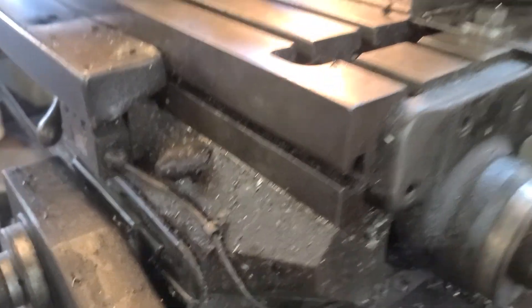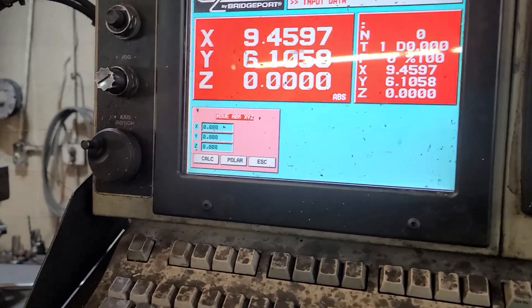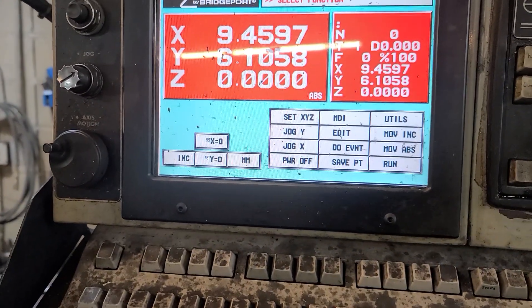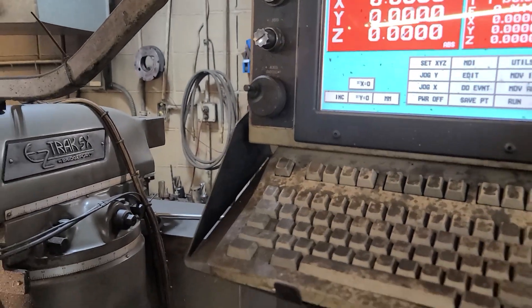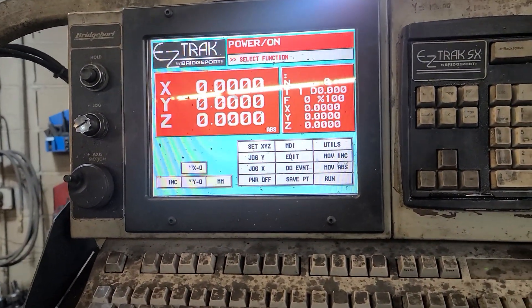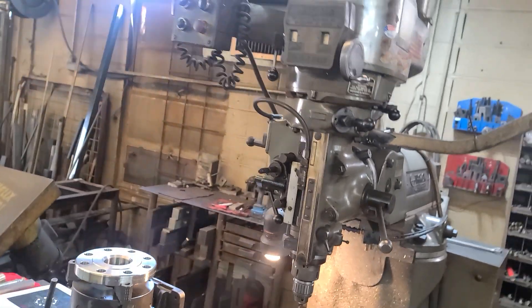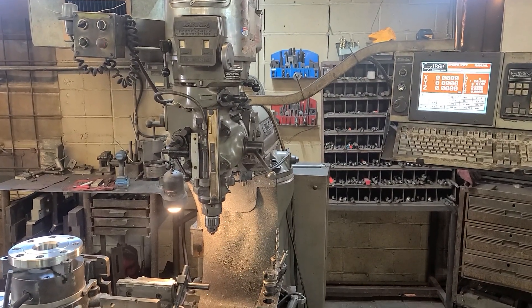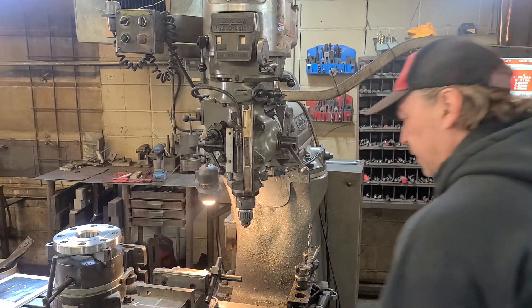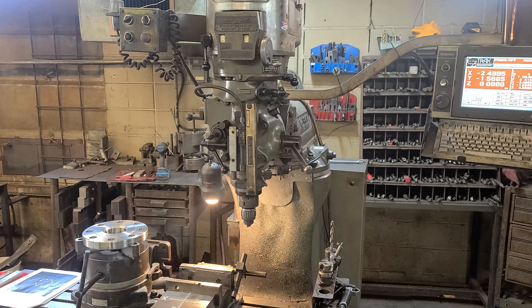Look at that — there's where we're at, and it says 'Home.' You can home it right there. Escape. 'Set XYZ' — this is, you don't, it doesn't even need to do this. So there — home, home. Turning on and homing the Easy Track. So at this point you need to hit 'Power Off,' which is going to turn the servos off. At this point we can manually move it, or you can go into jog mode. Like I said, this corresponds to the 10-key.